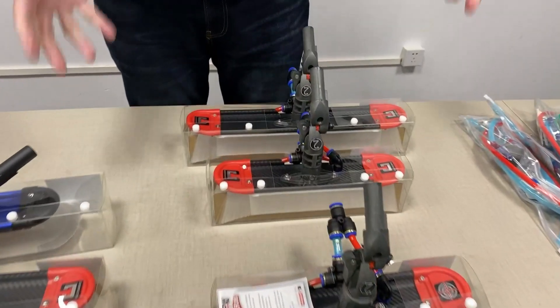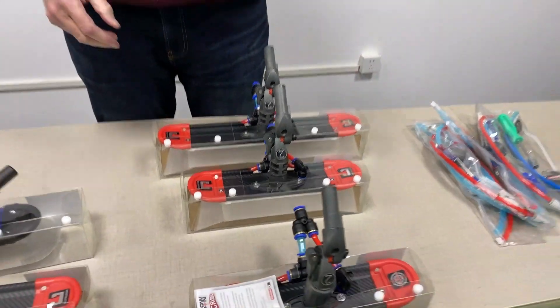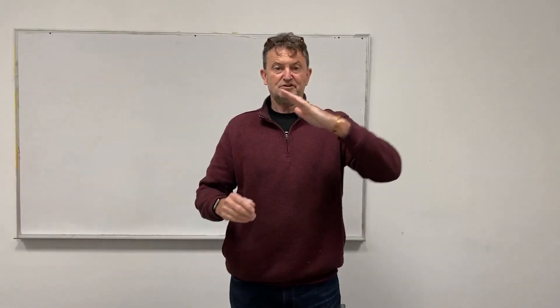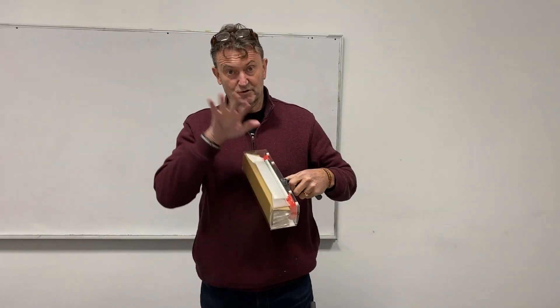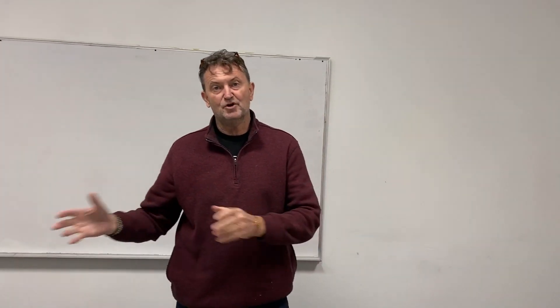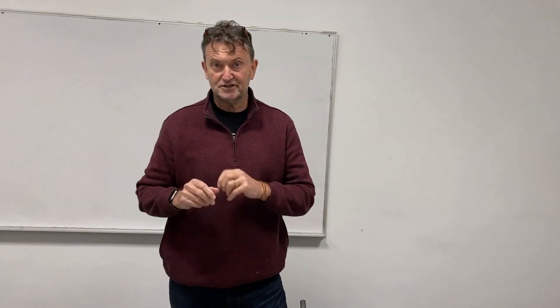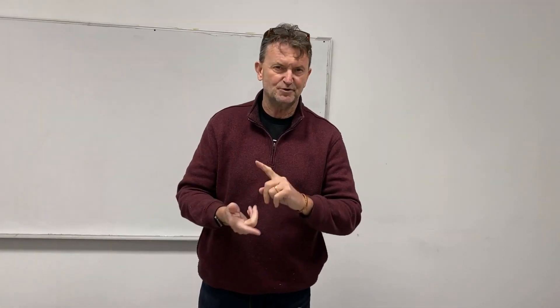There are three ways to agitate. Why would we have different brushes? Nylon bristles scratch — either at an angle or straight up and down, depending on position. The center ones are up and down and the outside ones go at an angle. This is a standard water-fed brush for regular work. However, there are some things that don't come off the glass with bristles and scratching: hydrocarbons, bee poo, artillery fungus, paint overspray, all those sorts of things. That's where we have window weapon.